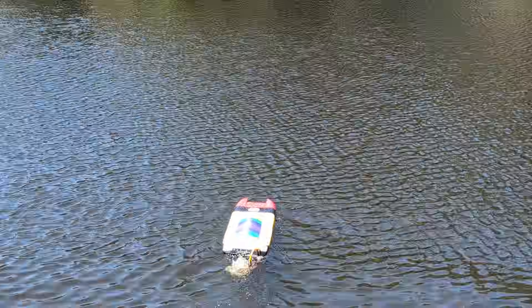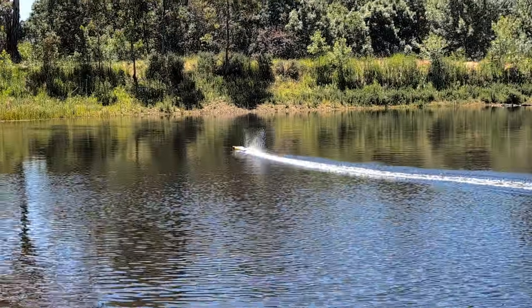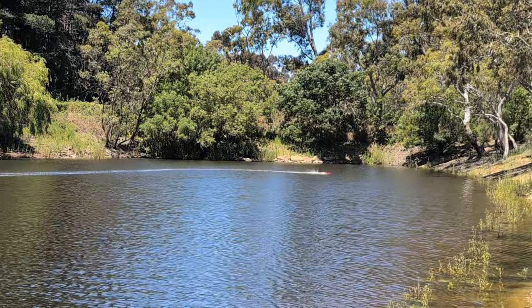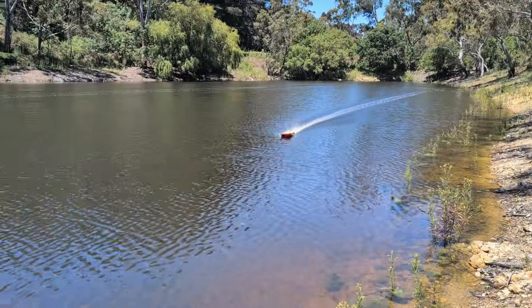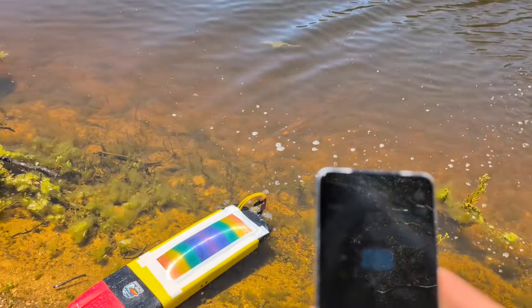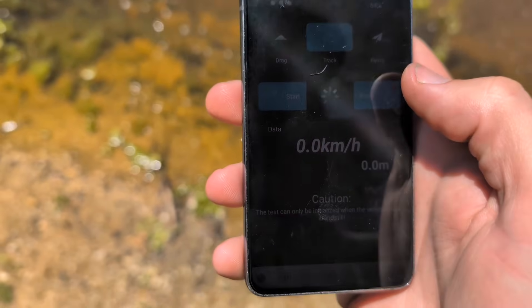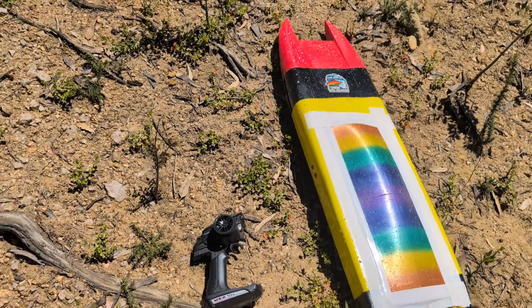So, 65.14 prop. The 61.5 is faster than the 57, so this might be too much. It didn't sound quite as many revs. The result came back at 83 — a little bit less than the 61.4. So it's not loaded up too much. Let's try a three-blade prop on there.